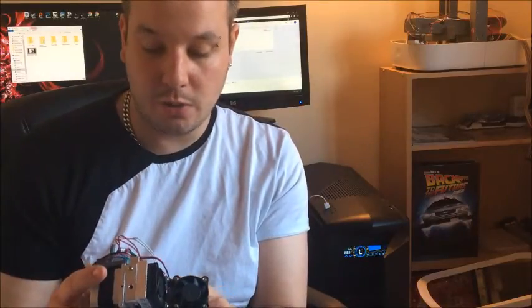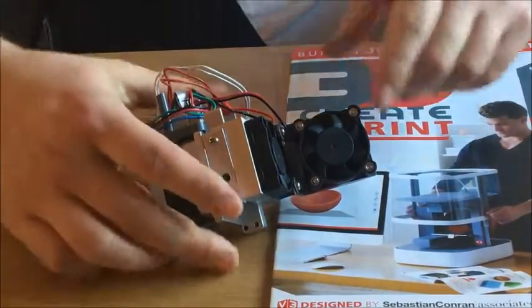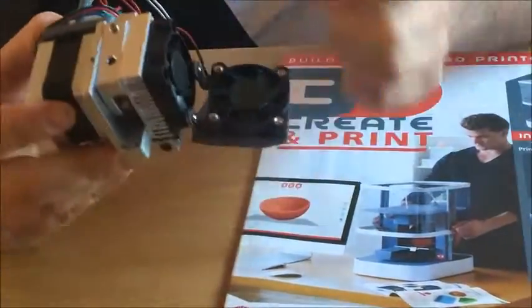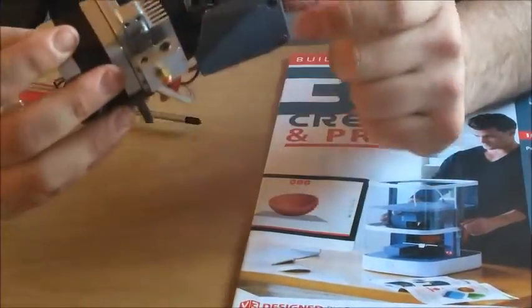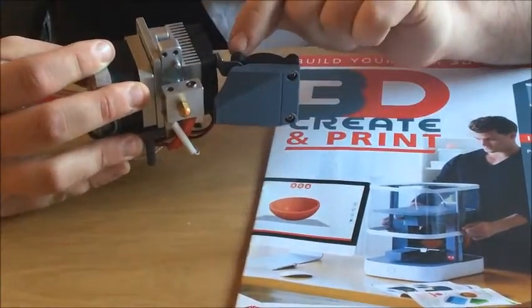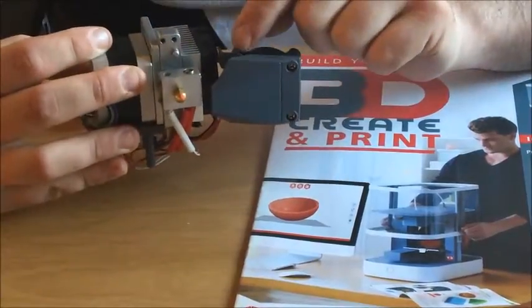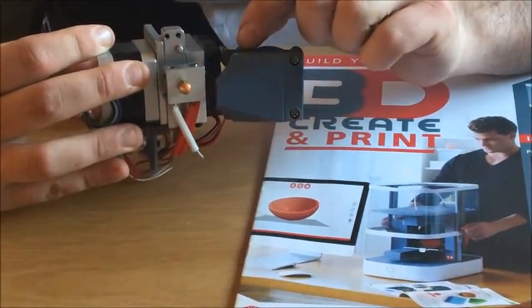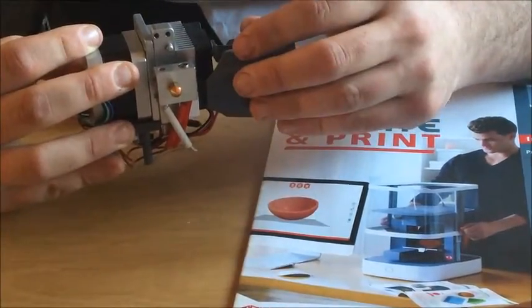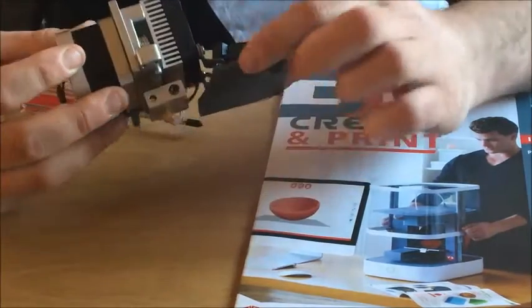Today I'm going to talk about what I've done to rectify this and another issue with this design. The second issue is one I think most of you will have: when you fit the scoop that attaches to the bottom of the fan, the screws that attach the secondary fan through the brackets are not flat screws — they're domed — so the nozzle will not fit snug onto the bottom of the fan.